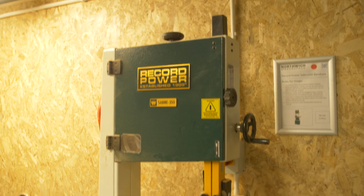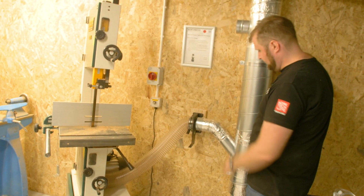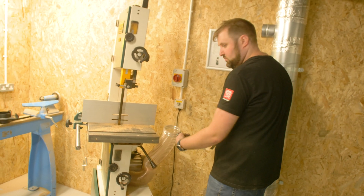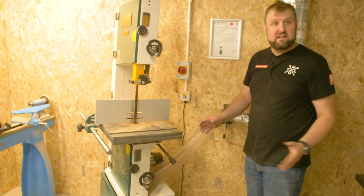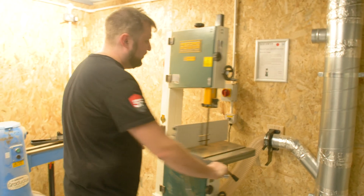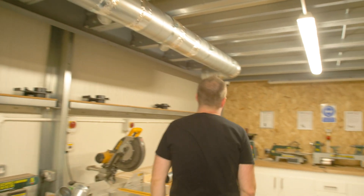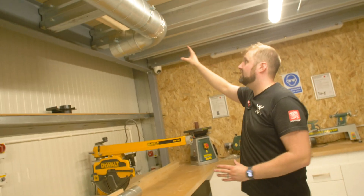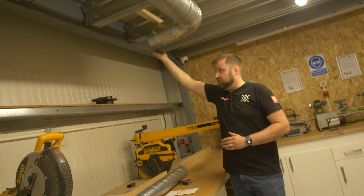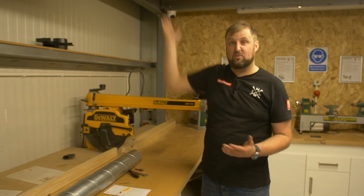We've made loads more progress. Starting with the bandsaw — this is plumbed in properly. You can see we've got the 200mm main body of our ducting system, then a Y here which goes to a blast gate, then a flex hose which goes to the bandsaw. Every flex hose is on a quick release clip, which means we can move the machine out of the way easily for cleaning or to attach something else. That's the first machine finished. We've got 200mm ducting all the way across the ceiling now, all really solid — about 10 metres up the wall 2.5m and then all the way down with 5 branches coming off, 4 Y joints, and at the end an elbow with a reducer dropping down to the radius arm saw from 200mm.